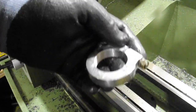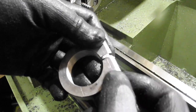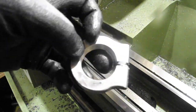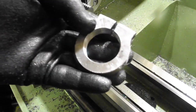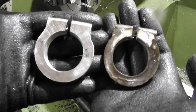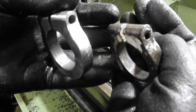After removing the stud and both spacers I used the snap gauge to compare the bore in both the original component and the new one. The new one had sprung by about 5 thou, which is neither here nor there really. The guide did actually send me a photo of the part fitted and stated that the fit was perfect — not bad for saying I didn't have any kind of thread gauge, not even a bolt.